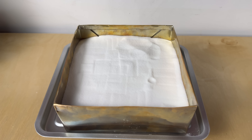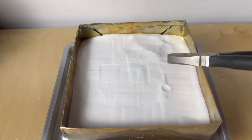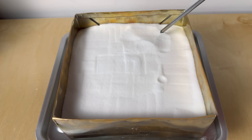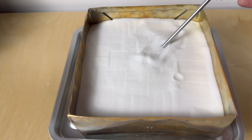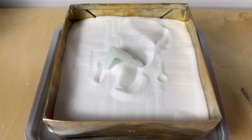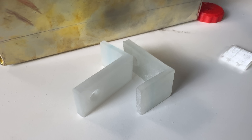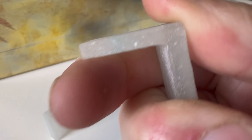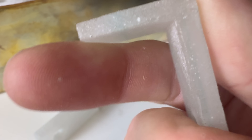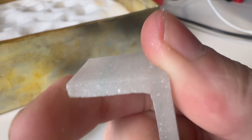Here it is after about an hour in the oven, and it's been cooling for about another hour after that. The salt is still really hot, and I don't want the part to still be too hot and warp or bend. It feels pretty solid though. Wow, that looks really nice — it's got a really granular texture and it doesn't look 3D printed at all. I didn't really know salt annealing would be that easy. The benefits are simple: instead of an anisotropic material weaker along the layer line, we now have a homogeneous part that's consistently strong throughout — basically the full strength of the plastic material.